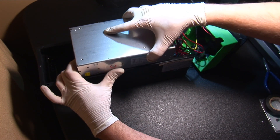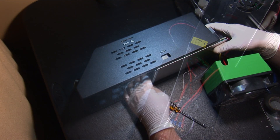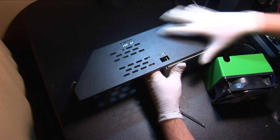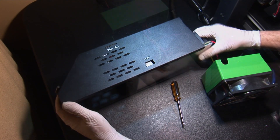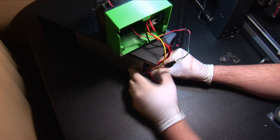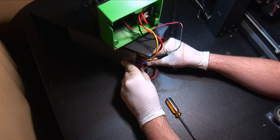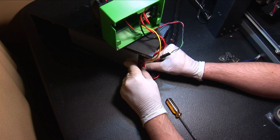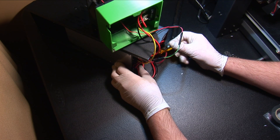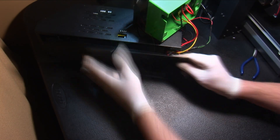The leads for the MOSFET board were too short. The bracket I used placed the MOSFET board near the vents towards the front of the case for good cooling, but that's away from all the other wires. I had to disconnect the leads from the power supply and reconnect them while the power supply was inside the case. An easier solution would be to use longer leads — just be sure to use the same gauge or thicker wire.